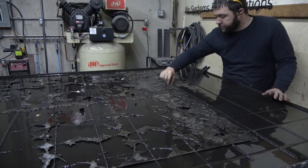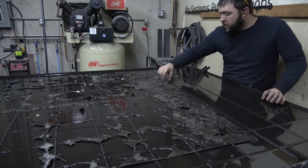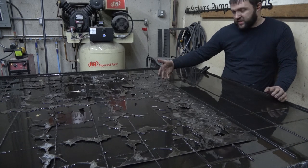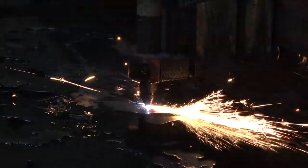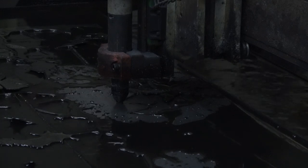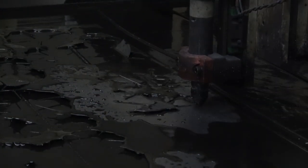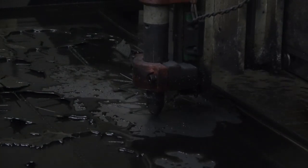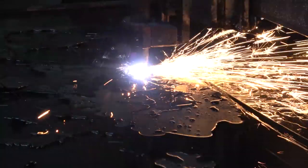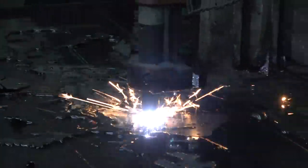What I'm doing is showing you where that cut went through. These are our rose kits, and that piece I'm pointing to was where that damaged piece was. It cut just fine. You can see, just being hidden by the torch now, that little ripple that's left over. The way this cut went, it wasn't a big deal. But if the cut had been something that was going to touch off or pierce from there — especially on a table with no torch height controller — if I pierce off something that's bent up, I'm going to have a wrong Z height for that entire cut. The cut's probably going to go bad, I'm going to have consumable waste. It's just all around a bad deal, so it's something to avoid.